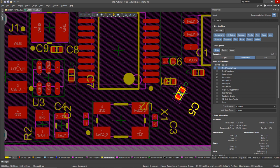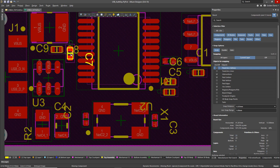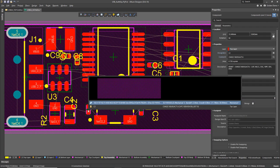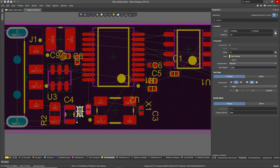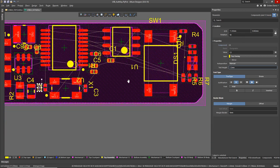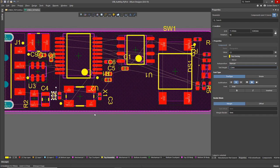I'd swapped around their locations, so let's just place those, and that one needs to be rotated. I'll just adjust a couple of things — a few minor tweaks. These parts here I need to rotate as well — those are load caps. I want to move the designators; I'll do more designator tweaking later on after we've routed the design. So that's pretty much it there. I'll save that.